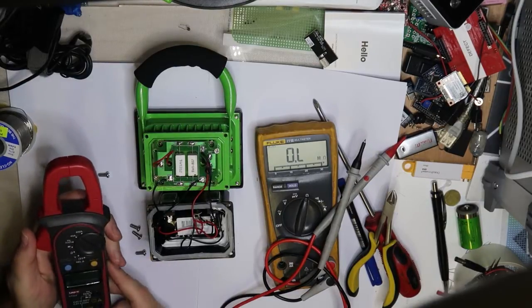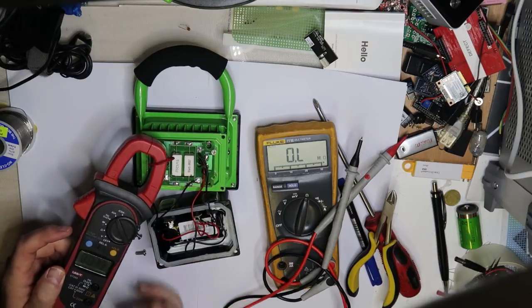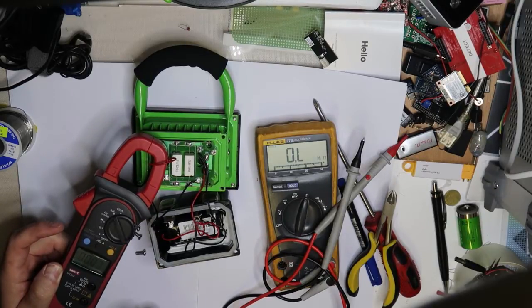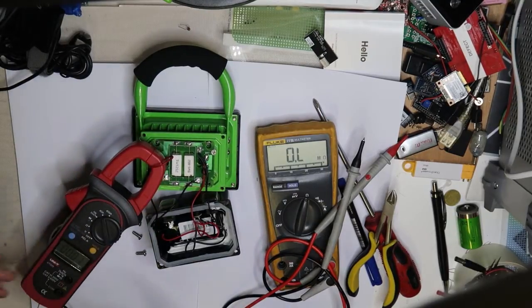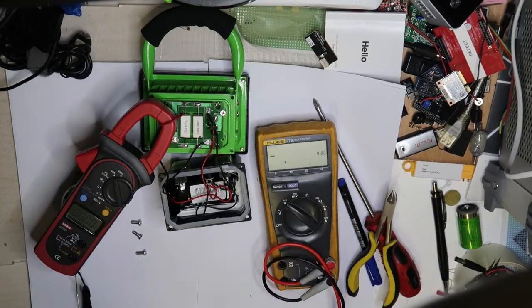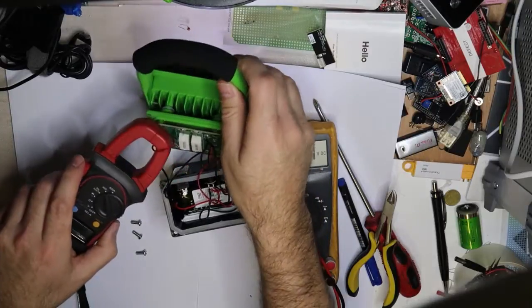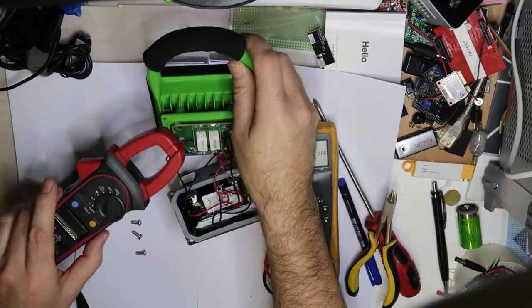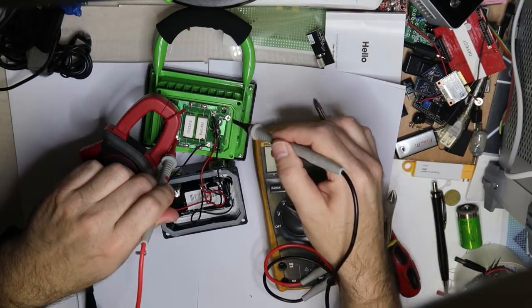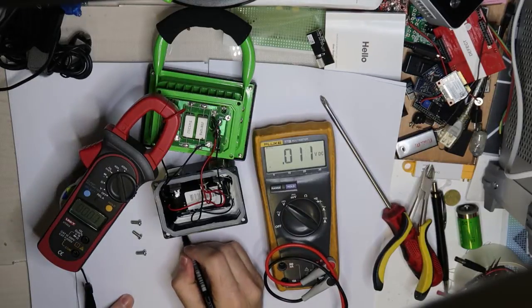Let's do a calibration — now it is calibrated to zero amps, because magnetic fields affect the reading. Now we measure the power of this LED. I'll power it on high, and measure the LED voltage — which is about 5.2 volts.